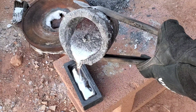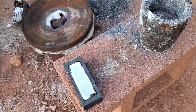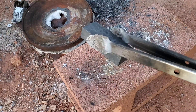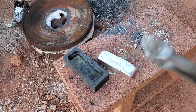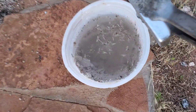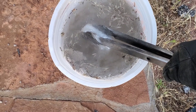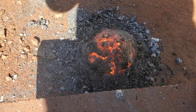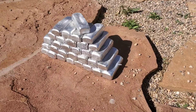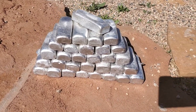It's easier to pour if you get rid of all that junk on the top, but my tongs weren't doing a very good job. I need to figure something out to make it better. Here's some nice shiny aluminum — it's been purified, recycled, whatever you want to call it. But listen to that sound — that's one of my favorite parts. This is all the scrap that we pulled off, still hot. But this is what we were after: nice aluminum ingots, and quite a bit of them.